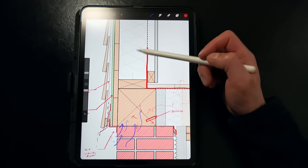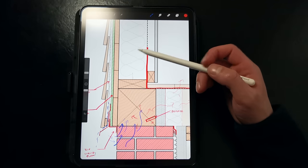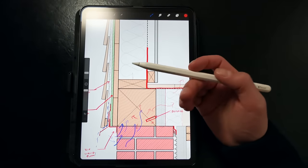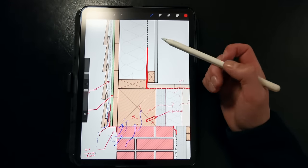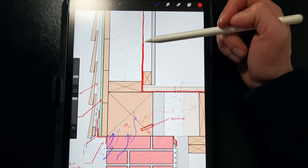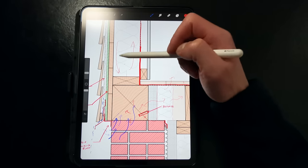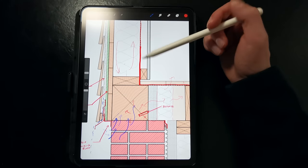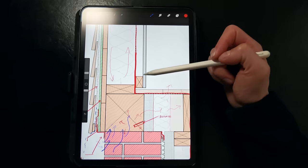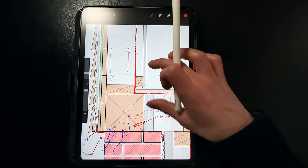Back on the interior side of the wall, we have mineral wool batts within the stud cavities — you could also use blown-in cellulose, fiberglass, or wood fiber — basically we're looking for something vapor permeable so that our wall assembly can dry to the interior or to the exterior. We're preventing air leakage and condensation with our smart vapor retarder membrane on the interior, taping those joints so it's airtight and prevents any convective looping that could deposit moisture into the cavities. We're also installing those same 2x3 furring strips for the airtight service cavity, and then the gypsum board can be attached directly to those.